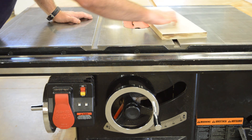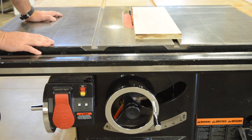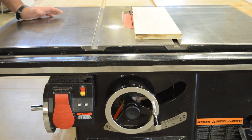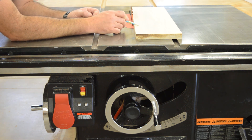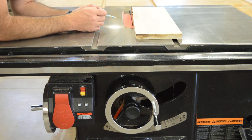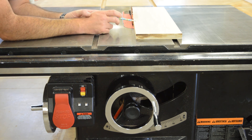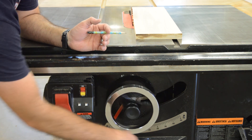The next thing I want to do is create a good height for cutting this board. I would say that this is way too tall for cutting this thickness of material — there's a lot more blade exposed than is necessary. I don't need the blade this high to simply cut through this board. So I'm dropping this down, and I want to get that based on the middle.